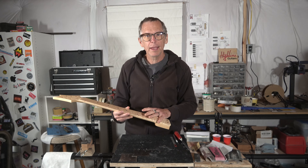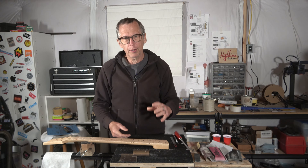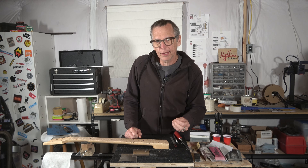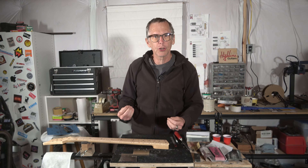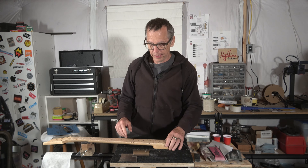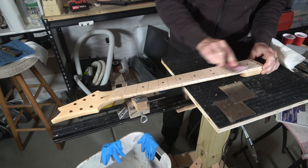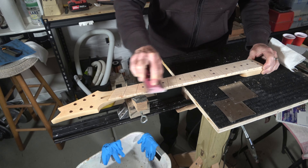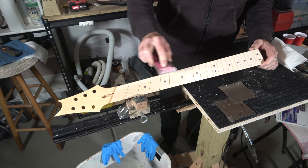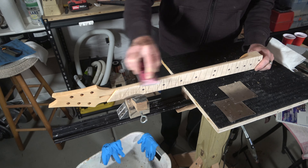You can't feel them and you can barely see them, but just knowing they're there means I've got to fix them. What I ended up having to do was go back and sand those areas where I could still see the tool marks, starting out with 220 grit sandpaper, then jumping to 320, then 400, 600, and finishing with 800 grit, getting it really smooth.